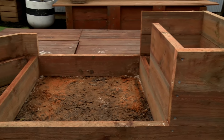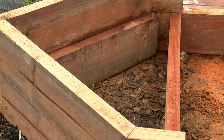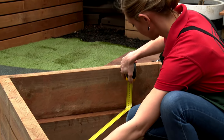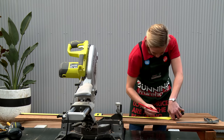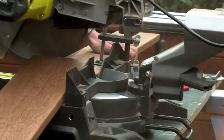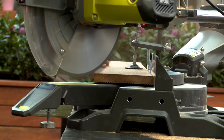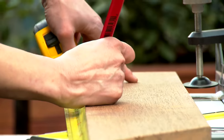The hull of my boat is now complete by building up layers around the base. Now I'm going to add decking in the bow and the stern so the kids have somewhere to sit. Measure the space at the bow — for the bow, I'll need a few mitre cuts, but the stern will be more straightforward with plenty of straight cuts. Cut your first mitre and then, measuring from the long side, measure out the length you need for your piece of decking.